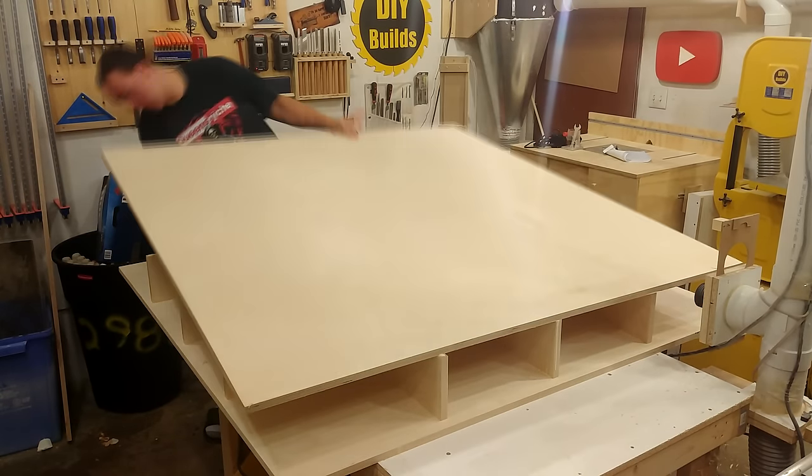With the door now installed and fully functional, I take a scrap piece of plywood, rip it down to about an inch and a half wide and the proper length to fit between the shelf and the top. This is going to be used to add a window to the right of the door, as the door does not stretch across the entire front. In order to power everything, I'm going to be using a power bar with a surge arrestor and an on-off switch. I drilled a big hole in the bottom to run the plug outside, and the power bar was screwed down so it didn't move. Using a couple spacer blocks at the same height on both sides, I drop in the shelf with all the electronics in it. Once the shelf was seated properly, I drove in two screws on either side — one into the leg, one into the dividing wall.